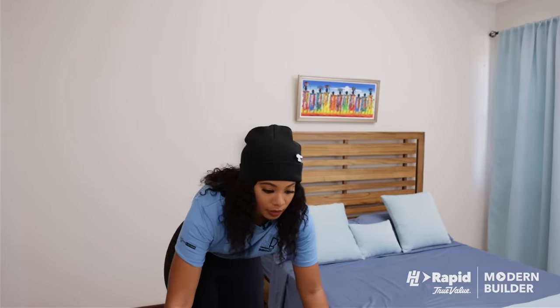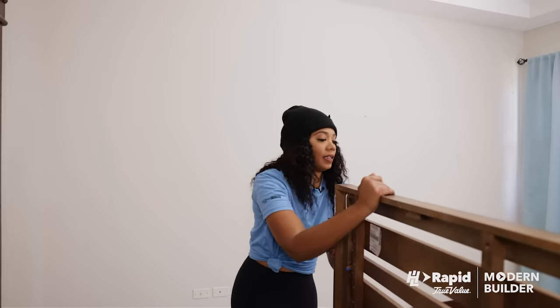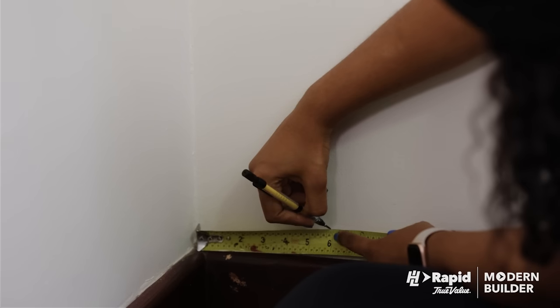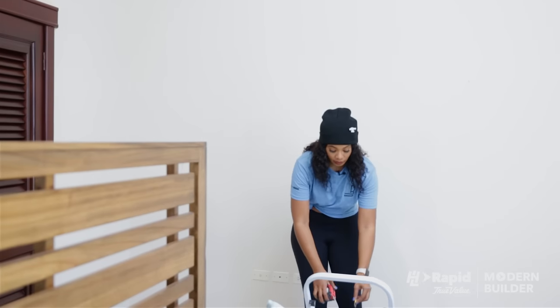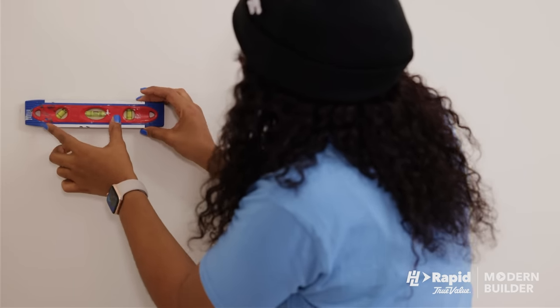Measure your walls. I gave you a few tips in my DIY video for how to paint vertical wall stripes. Moving horizontally, use a measuring tape and a colored pencil to place a mark every 5 to 12 inches, depending on how narrow or wide you want to paint the stripes on the wall. Place the colored pencil against the level and extend each stripe line straight down towards the floor, drawing your line as level and straight as possible.